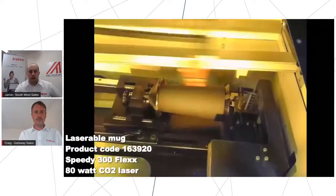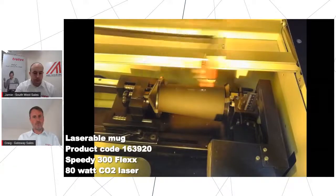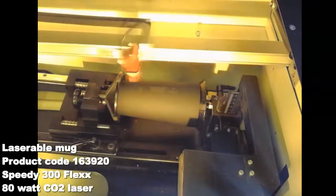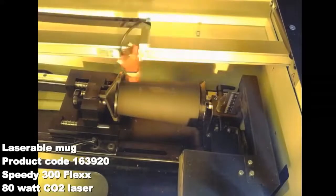With the rotary attachment we've also got a little video. So a rotary attachment for those who haven't got one or haven't seen one — the laser works in the same way: we move left and right and raster over the top. The rotary attachment basically clamps the product and rotates it. As you can see here on the Speedy 300, the laser head comes straight into the center point of the rotary attachment. All we need to do is find the center point of your cup or your mug using the red dot pointer as live feedback, so you can get a nice central position.